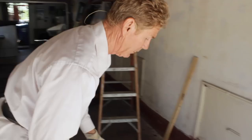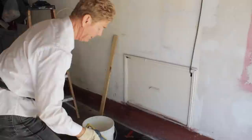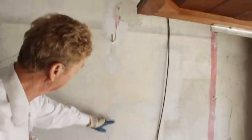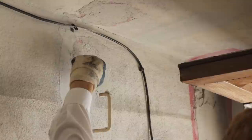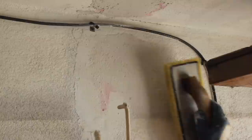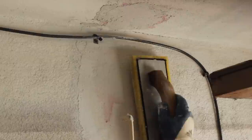I'm going to tap this bucket out. Always put your brushes in water — otherwise those would be hard as a rock. Now I'm going to hit these other two patches. The fellas who did this — this is much better, they blend in a lot tighter. For the sake of showing you what I'm talking about: you take some of the material from the middle and bring it out to the edge of the existing. That's how you feather in a patch. The same with the exterior — exterior patchwork is the exact same method. You take it from the inside and go to the outside. That makes the difference between a good-looking patch and an ugly patch.